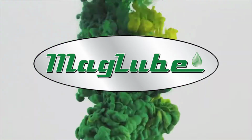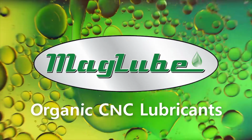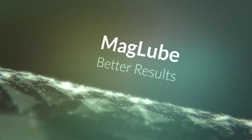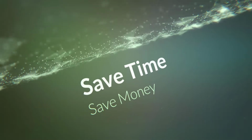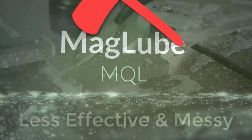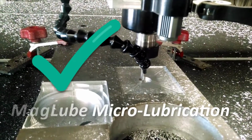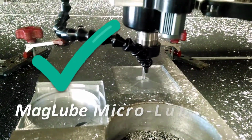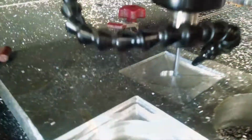Because of the properties of our organic, biodegradable lubricants, you will experience superior surface finishes. Another advantage of using MagLube MQL is time savings. Time is money, and unlike the extensive cleanup needed when flood cooling, MagLube systems require virtually no post-production cleanup. Plus, the cutting chips produced are dry, making it quick and easy to simply vacuum up and then recycle for even more revenue.